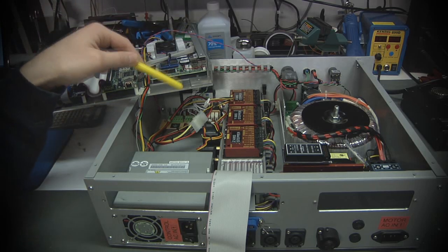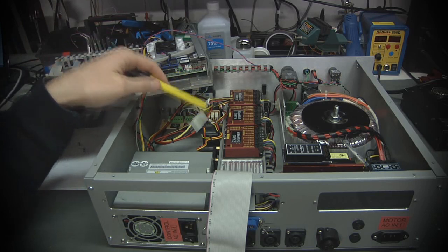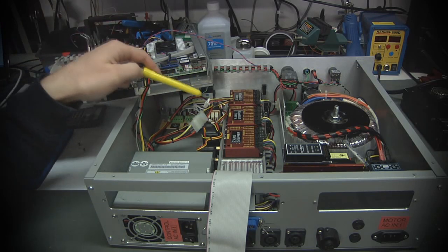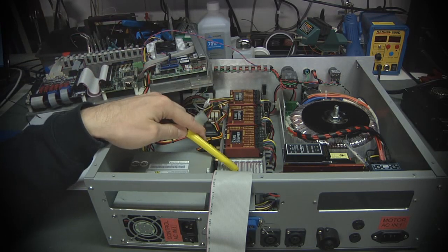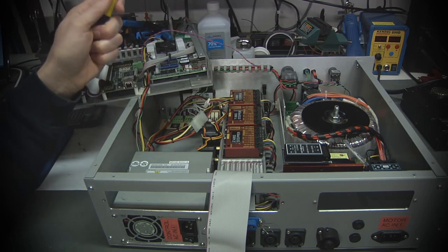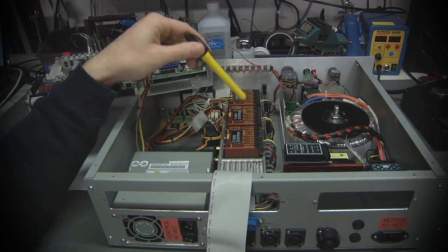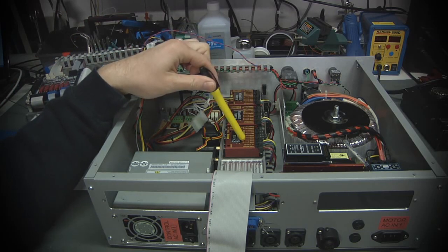The most important thing that's going on probably on the lower level here is that this is where all the stepper drivers are mounted. I've got an aluminum plate that I machined. This is actually one of the first pieces of metal I cut on the CNC machine. This mounts up to four Gecko footprint drivers, and these are G203Vs. I have three of those for X, Y, and Z.